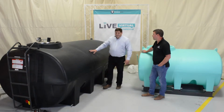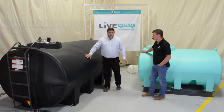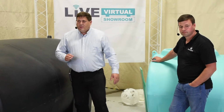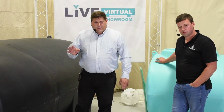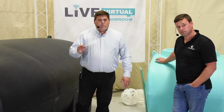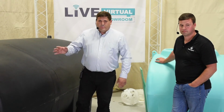And I'm going to tell you, guys, if you're going to get the baffle in there, it does a whale of a good job. We have a video coming up here in a few minutes that's going to show you the difference with or without the baffle, and let you see the difference. But get it installed at the factory. When you order your new tanks, tell them to install the baffle in the tanks. You don't want to be doing that on existing tanks because you don't know what's been in them, all them reasons. It's just better to get it done here.